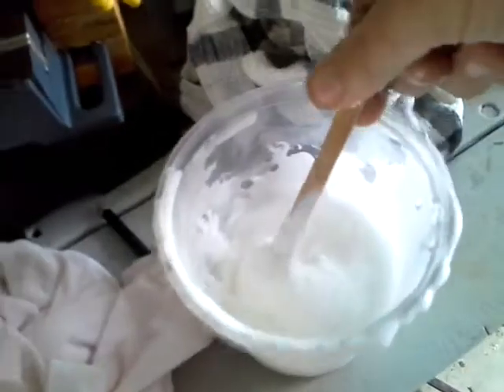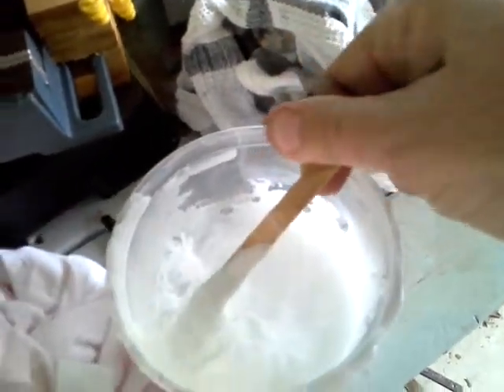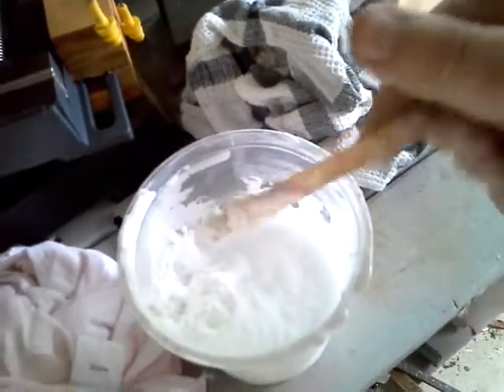As we can see, we've got the resin. I mixed a bit too much of it up, but you can see that it really is setting up. It's gone to this stage which means you can't work it anymore — that's it, so that's gone. You can feel the warmth in the cup; it's getting hotter and hotter. So you just want to put that somewhere safe where it's not going to catch anything on fire.